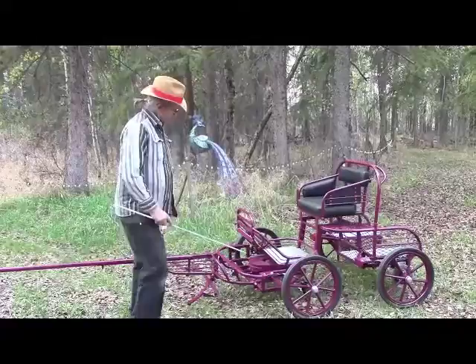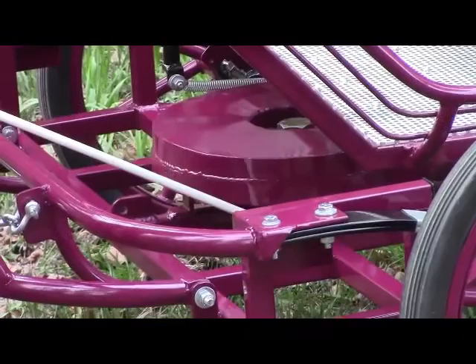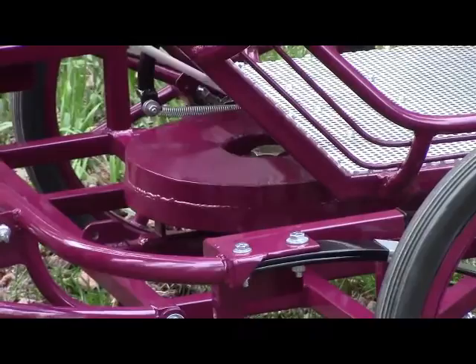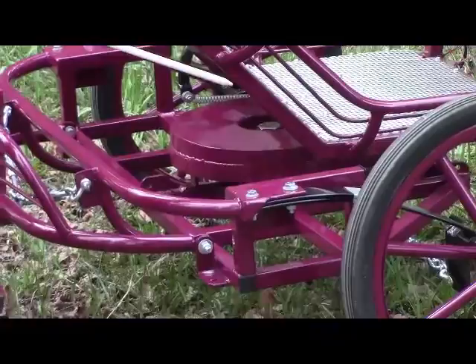It's two steel plates with a plastic disc in the middle. It's clean — there's no grease and no need to lube it. This particular fifth wheel has a lip that comes from the top of the fifth wheel down past the bottom. Any water that gets up in there self-drains out. The center can drain through the center, and anything that splashes up in there is kept out because of that lip. I call it a gravity seal, and it works well.